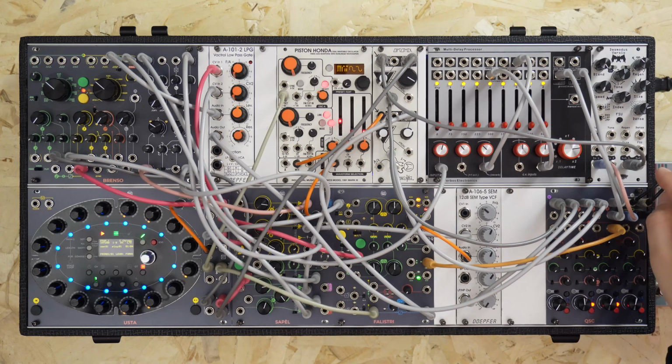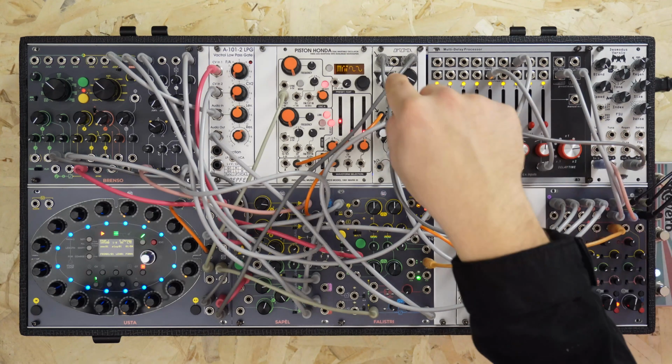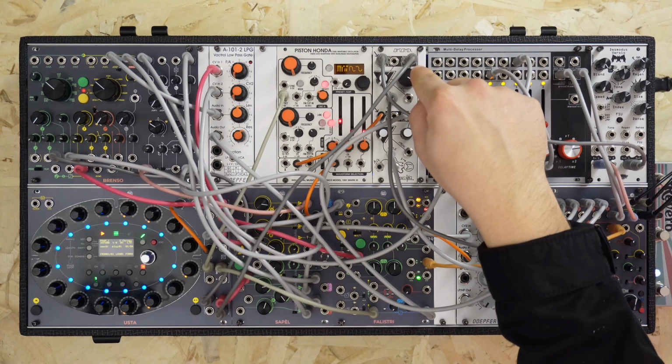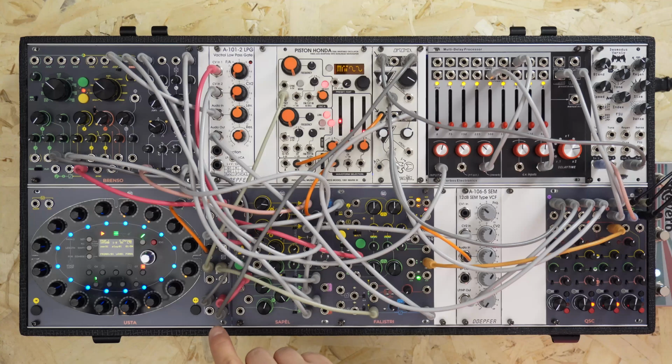So I send the output of the Desmodus to a channel of Optomix, and the low pass gate opening is controlled by a gate coming from track 4 of the Usta. I create a sequence of continuously present gates, like I do for the string section, that remains muted directly on the sequencer until I unmute the gate, allowing the reverb to be heard.